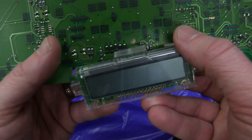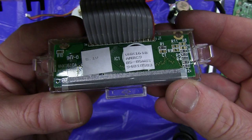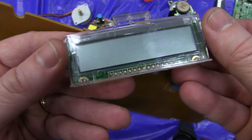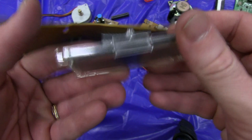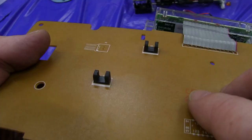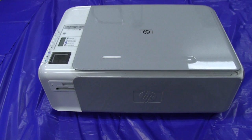Actually, I was staying corrected on the LCD module from this thing. It looks like it's a standard Hitachi interface one — VHX 1610, looks like the standard interface at least. You could definitely use that. That's a nice little module with a plastic protective case. You could certainly add something like that as an LCD to a product, and it's fully protected. Very nice. That's useful — I'll scrounge that one too. And I missed these even on this front panel board: couple of little photo interrupter sensors there, worth desoldering.